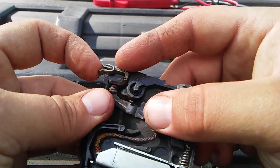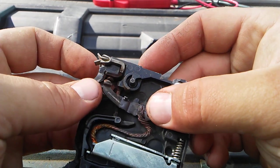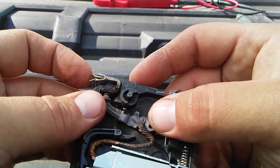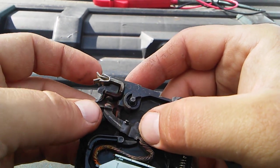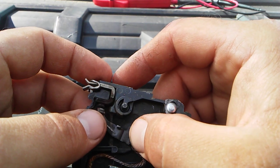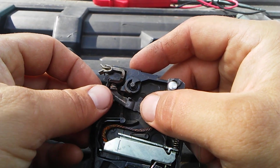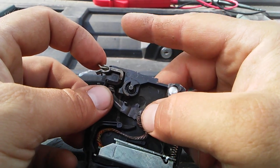I don't remember five years ago when I put the panel in whether these were all tight and snug. Maybe they've changed the design since then. I've never had this problem out of full-size breakers — it's the only time I've had this problem and it's been with these slim breakers. It seems like they're skimping on components to make it thinner and cheaper. I understand that's the way the world works now, but something as important as a circuit breaker — it is the job and function of this thing to keep your house from burning to the ground. And it seems to me this thing is almost the cause of causing your house to burn to the ground.